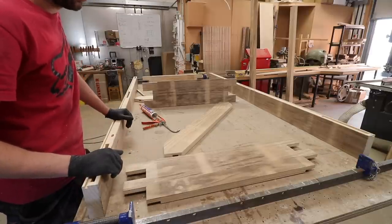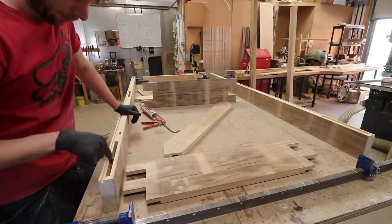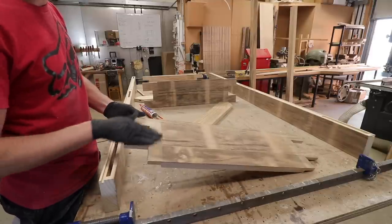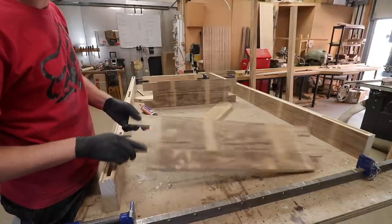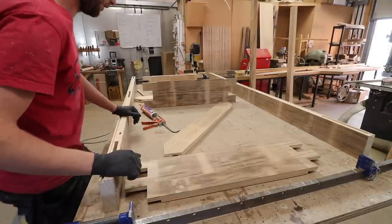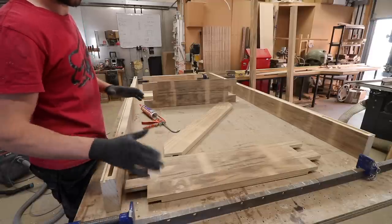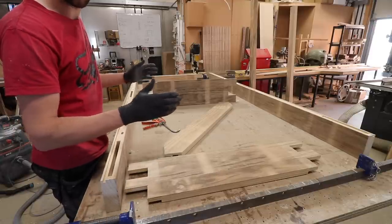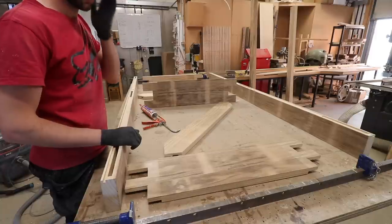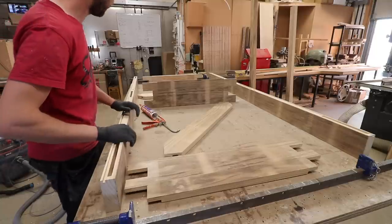Like I say, you've not got a lot of time, so I'm going to be concentrated and not really talking through it. The aim is to get as much glue as possible on the insides of the joints and just coat the rails with just enough so that it soaks in and leaves a small residue on the surface. The more excess you get on the rails, the more glue squeeze out you get and the messier the glue up is. The joy of having the braces already cut for the door in the square position is we can set our clamps slightly biased so it pulls it tight against them braces. So we know that's the perfect square position, so we can clamp it up with a view to working them braces in nice and tight.